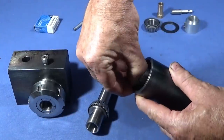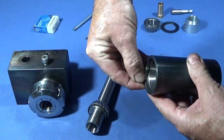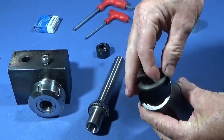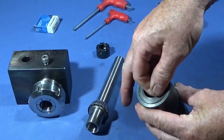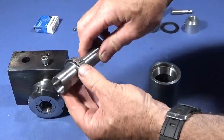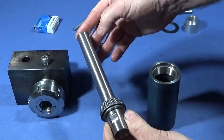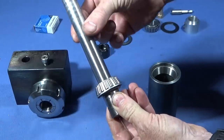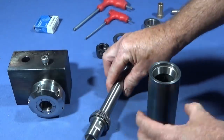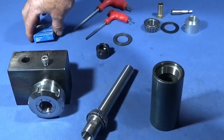You can see there that I've actually bored the bores for those bearing cups a bit deeper, leaving about 6 millimeter at the front here, and that's for the Delrin seals that I made to go over the front of the tapered roller bearings to stop any swarf getting in the bearing. And I bought this ER20 collet chuck with a 150 millimeter length spindle on the back here. That's exactly 20 millimeter. It's been ground nicely, and I chose a bearing to actually fit that one and obviously fit the housing. And I'll put the number of the actual bearing that I used below.